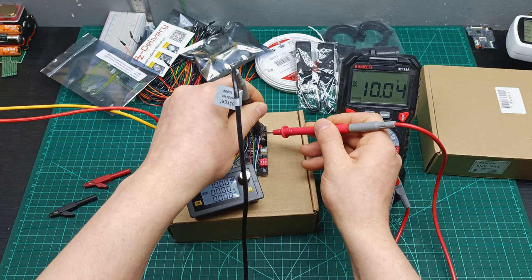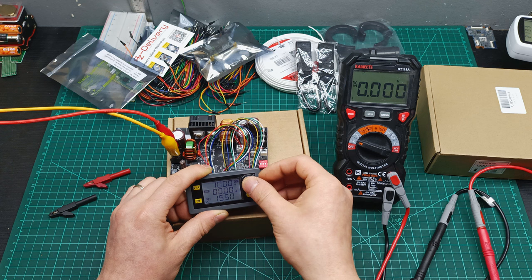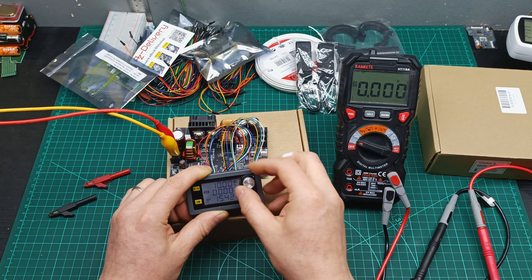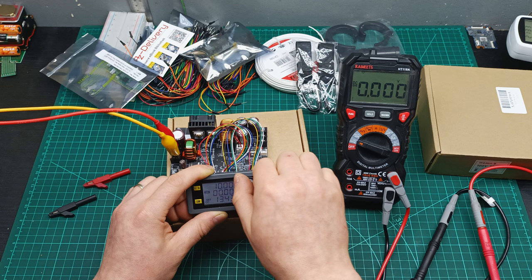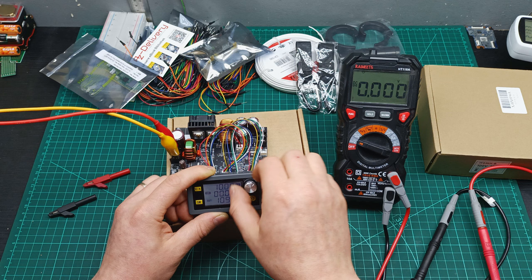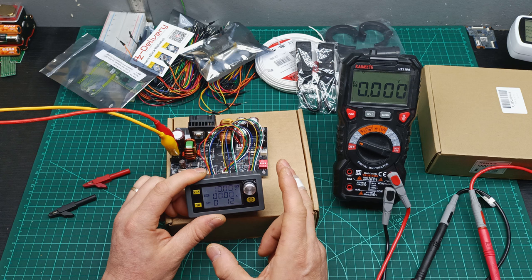And then I say that I can set up also constant current. Maximum doesn't go because it's on 15 maximum. So if I go just lowering, because it says 60 volts and 15 amps, and I need two to make positive, 0 and negative. But apparently I need to wait to see what's going on with the seller, if he's willing to send me another item or give me money back, and like that I can purchase another item. But from here, yeah, we can adjust the constant current. Let's say just 5 amps. So now it's going to be capable to push out only 5 amps. And it is nice.